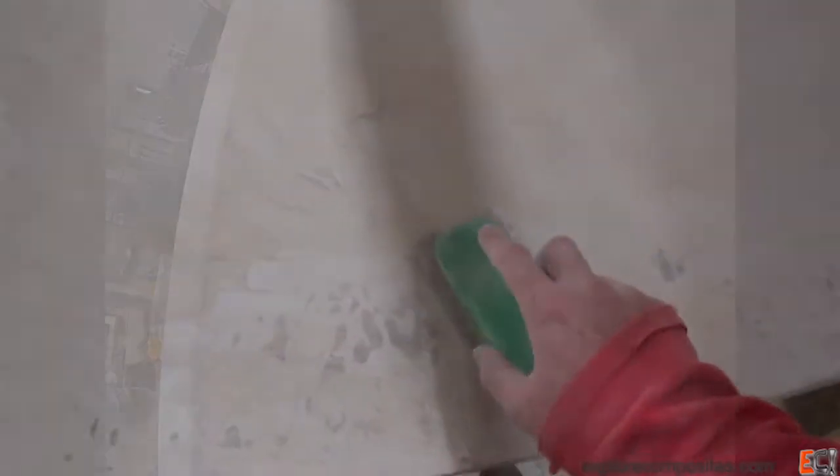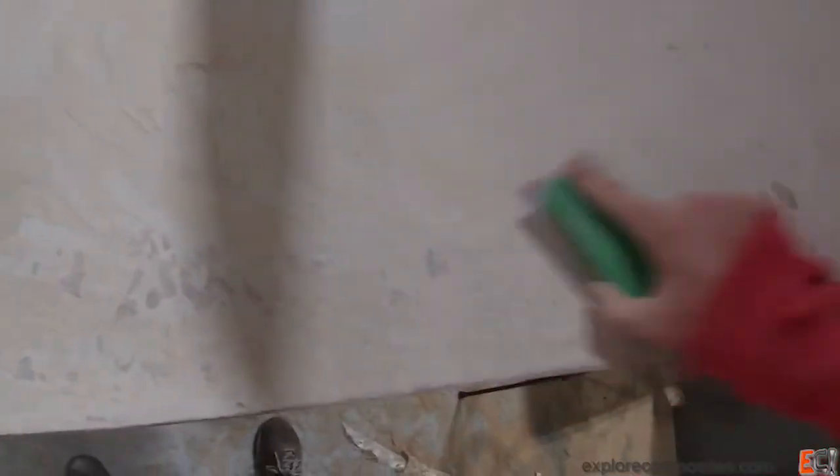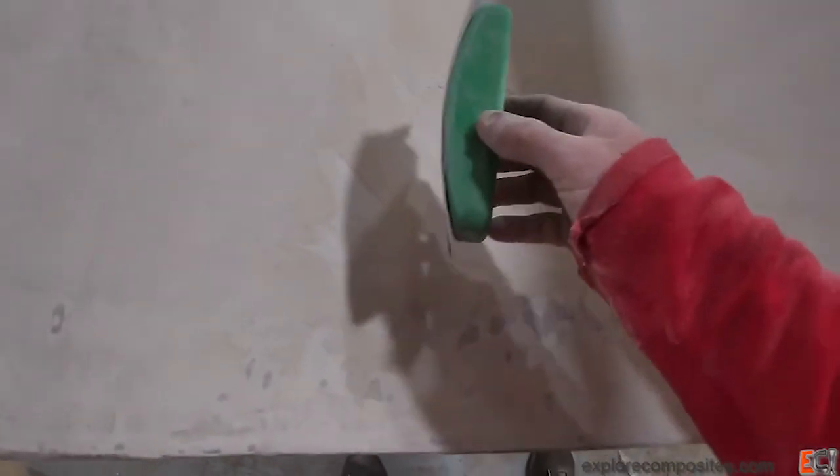After a good sand, the joint where the front and back meet up is eh, okay. There's a lot of epoxy drips burned through at the back end where the peel ply folded over, and where there's some thick bits of epoxy. I'm just working this really hard with some fairly heavy sandpaper to get it as flat as possible — sort of globally fair.